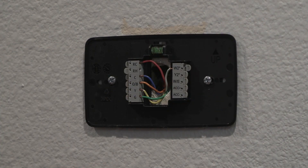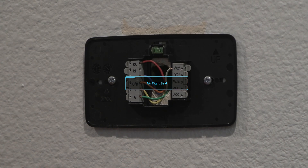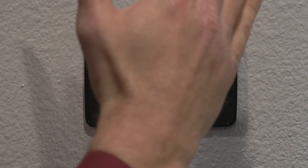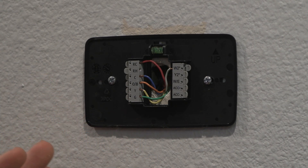Whenever you're installing a thermostat, you want to make sure that the hole behind it is properly sealed — you want an airtight seal. Any air back there will make it into the thermostat and affect sensor readings, temperature, and humidity. Especially if there's a pressure difference between the wall channel right behind the thermostat and the room space, which can change from one day to the next. It needs to be an airtight seal — the little hole is not good enough. Fill it in completely.